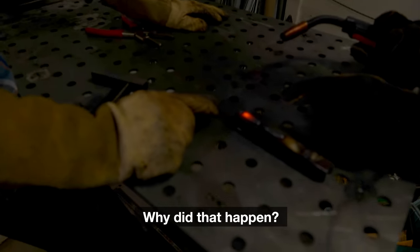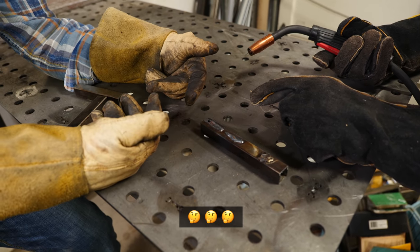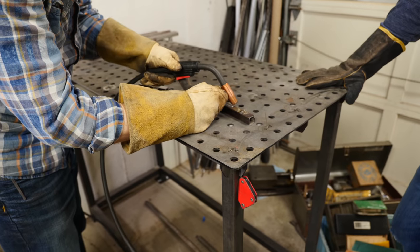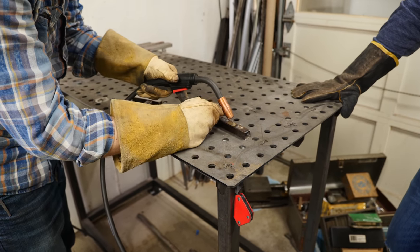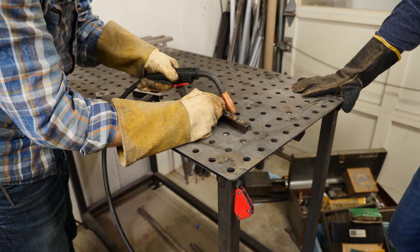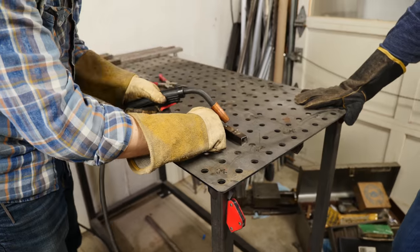See how it burned through? You were slowing down because you knew the end was coming up, so you just spent more time there and it got hotter. Also, we'll sometimes use this as a pivot point so that the W or C motion is resting on my finger instead of trying to hold it like this — kind of resting. You don't necessarily need to hold it; having a little support helps.